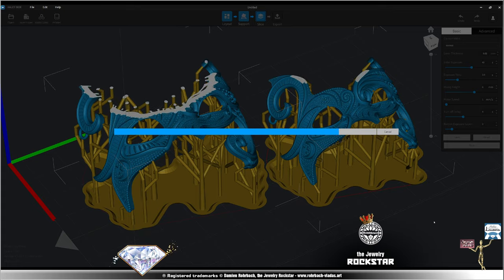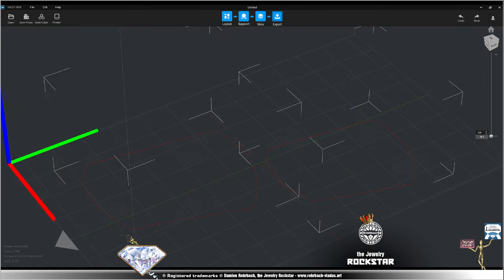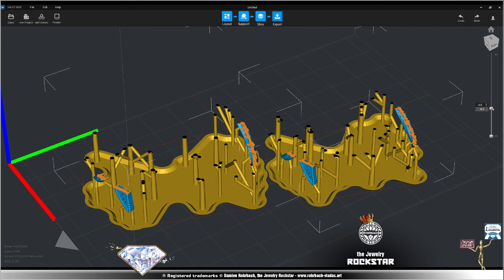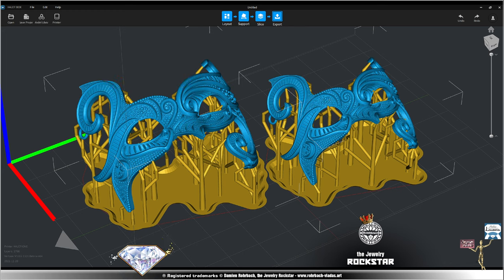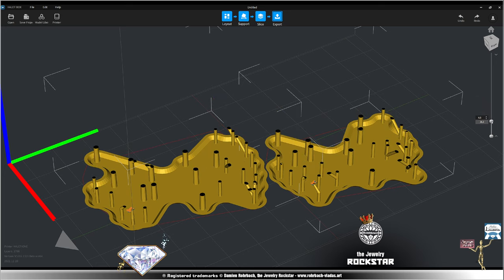Now that the pain in the neck of placing the supports is done, comes the happy time of slicing. Now it is very important to mention that the settings for the slices, layers, initial exposition, exposure time, rising height, motor speed, bottom exposure layer and all these settings are specific to each resin and printer. Some printers have millions of settings, but generally good printers make finding those settings easier.